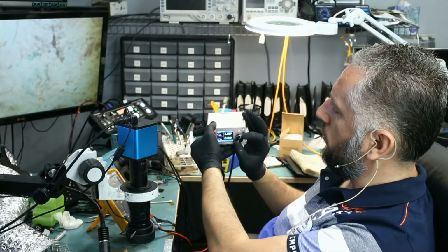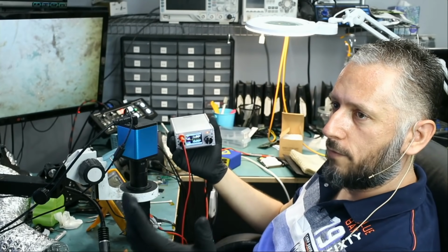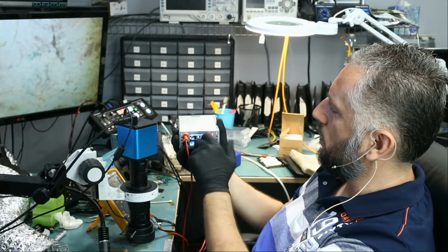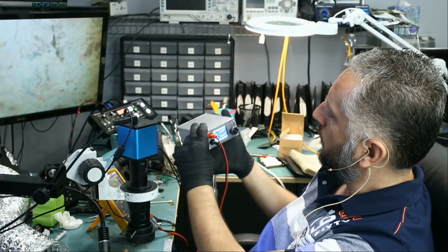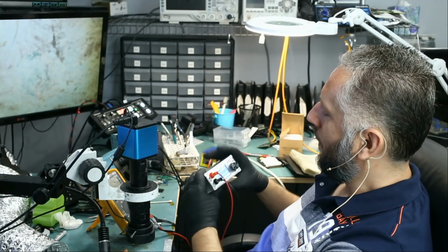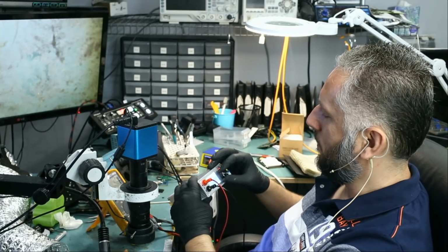Dial to change the voltage, press on that dial, dial to change current. That's it. I'm almost always at 1.5 volts, 1.2 volts, but this voltage injection power supply can go up all the way to what, 15 volts? So you can go up to 15.3 volts. If I press on that dial, how far can we go up on current? 20 amps. I'm almost always at maybe 5 amps, 6 amps, maybe 7 amps, but I never have to go up to 20 amps.